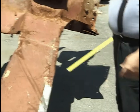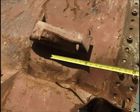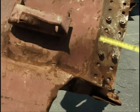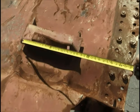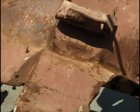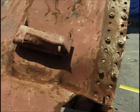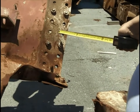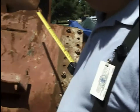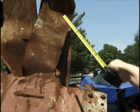Going down to the third — this is the lower. We have the step intact. We have a small cutout on the right; this was a sample that was taken. That on the left appears to have been breakage. This is where we had pull-through, and the bolts are still intact. As with the other two columns, we have collapse of the end of the beam and the end block is missing.